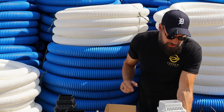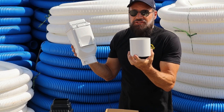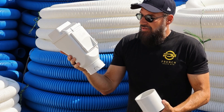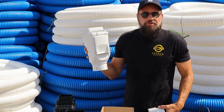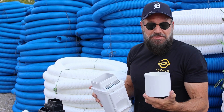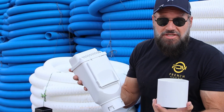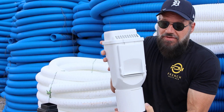Here's what the PVC looks like. We've got a lot of PVC guys out there who love their PVC pipe. We make a gutter adapter vented clean-out leaf filter that fits in PVC and also fits in corrugated pipe. Our vented clean-out leaf filter has UV protection — PVC does not. PVC pipe is made for inside the home and underground; it is not made for direct sunlight and has no UV protection. So if you're a PVC guy, that's fine, but keep your PVC buried and use our vented clean-out leaf filter above ground.